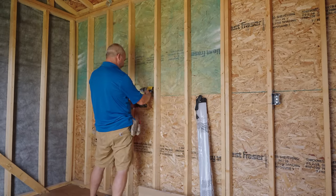Now, this is going to go in the box. We want to have a little bit extra, and then we want to have something to work on. So we're going to cut our wire here. Okay. The purpose of this switch leg, I'm going to leave all that wire on there. Okay, and I'm going to wire this as a switch leg right now so you can see the difference between